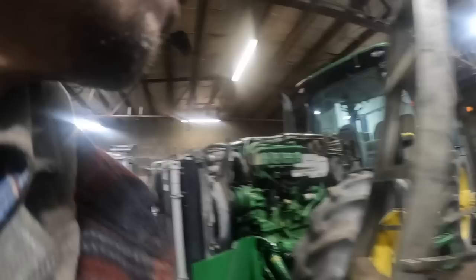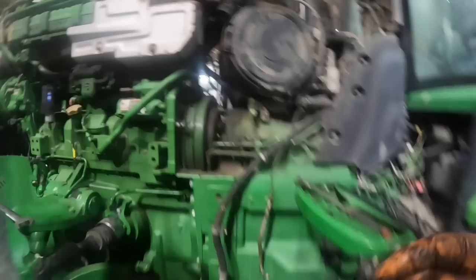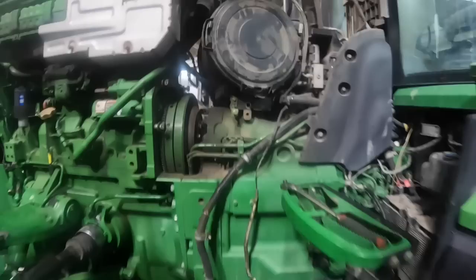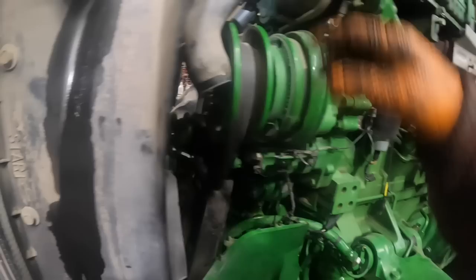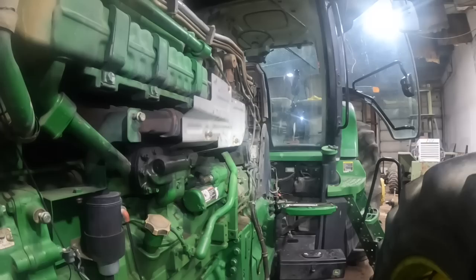Well, guys, it's about all I'm gonna do. What I got to do on this is I forgot all about it. I got the air cleaner all loose, but here's what we got left to do. We basically gotta get the turning tool on the engine, and then we'll turn around, pull the bolts out of the coupler there, and then we'll walk around the ladder here. We'll have to pull the fan off, fan drive and all that, lay it forward. And then of course, there's some more plumbing up here. This whole line bundle has to come loose, and then you'll undo all the clamps and brackets and lay the whole line bundle down off to the left side of the whole assembly, and then you can pull that air cleaner out this side.